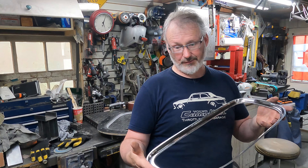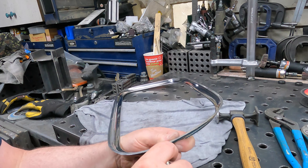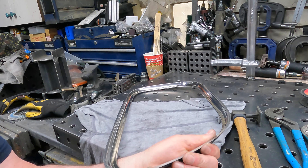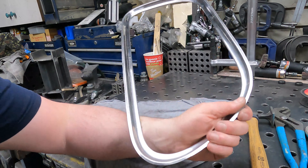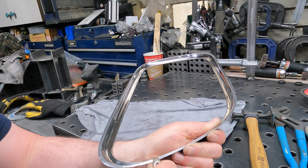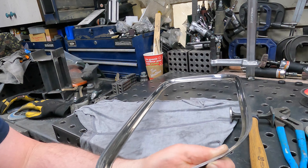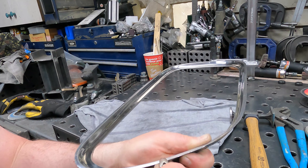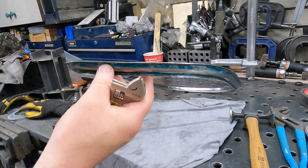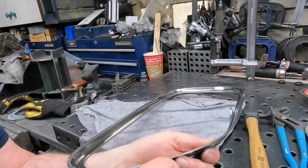Let's get rolling and see if we can get this one done. Just go very carefully — don't want to get too greedy. A little bit at a time. You just let the wrench feel the angle so you can feel the corner. Square it. Little tilt. That's it. I always figure if I can't move to the next position without having to change the opening on the wrench, I've bent too much. These little tricks don't need a million dollars. Sometimes it's hard to stop yourself from bending too much. I don't care if it takes an extra hour or even an extra day at this point — who cares.